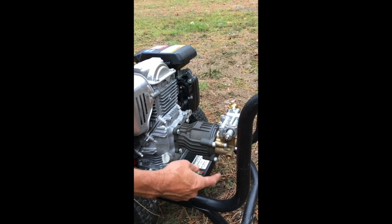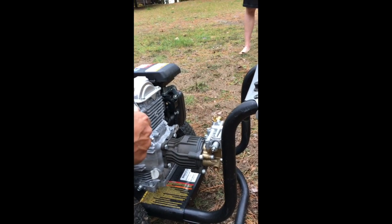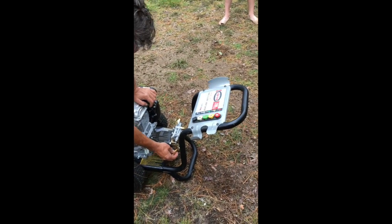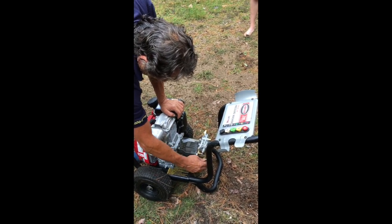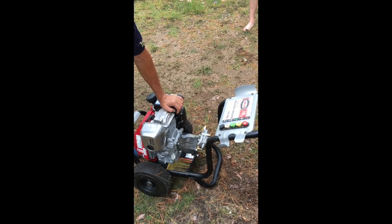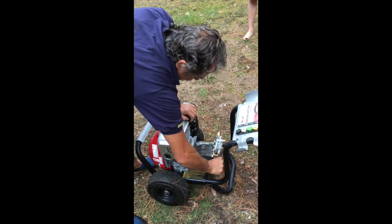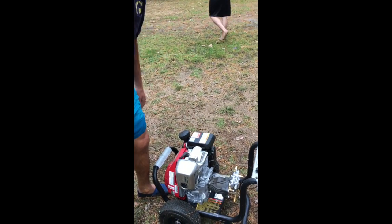What tells you there's no water in the pump? By drying it down and pulling it over. Here again is the lower chamber of the pump — there's no water. Water came out until it stopped. I also tilt it back to make sure everything is taken care of. I air dried it in the sun for a day and a half. Putting this back in — I always take it out and keep it out over winter and put a piece of cloth in there so nothing crawls in. I hand tighten it and then take an eighth of a turn with a wrench, at most.